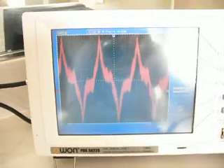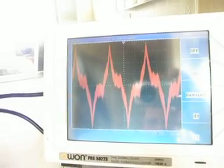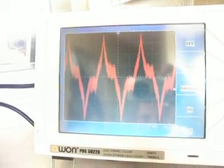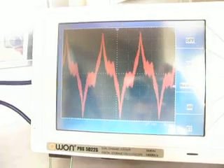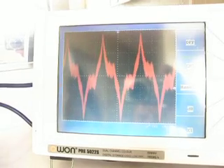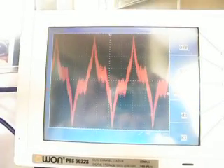As you can see, there's clearly an AC voltage on the grounding connection, and that was the purpose of this demonstration — to show you that if you don't have the correct setup when you're performing these grounding measurements, you may actually be misled into thinking that there is no voltage on the grounding system when there actually is. I hope you don't get caught out by this. It's very easy as an electrical engineer working in the field to get caught out by your test equipment, and it's happening all the time. Hopefully you'll never get caught out by this problem after watching this video. I hope you enjoyed this presentation, and I wish you the very best of health. Thank you.